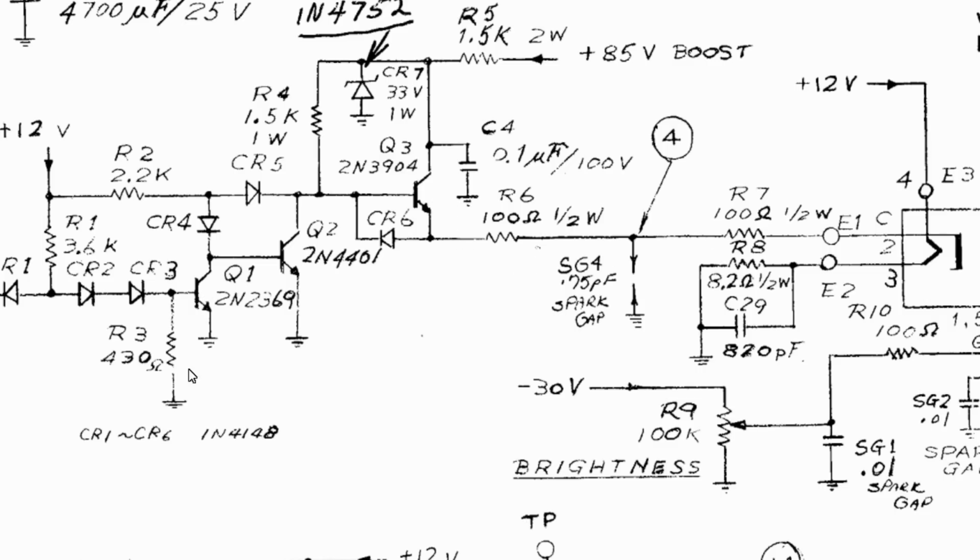Now let's take another look at the cathode circuit and look at where else things might be getting to ground. Well, here's a spark gap, but those don't leak, so there's nothing to worry about there. There's this capacitor up here, C4, but that's a ceramic capacitor, and those generally never leak. There's almost no chance of that being a problem. I also swapped out these two transistors just to test whether they were leaking, because those are connected to ground, but it made no effect on the spot.